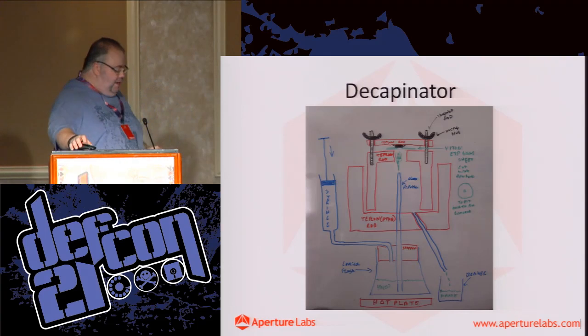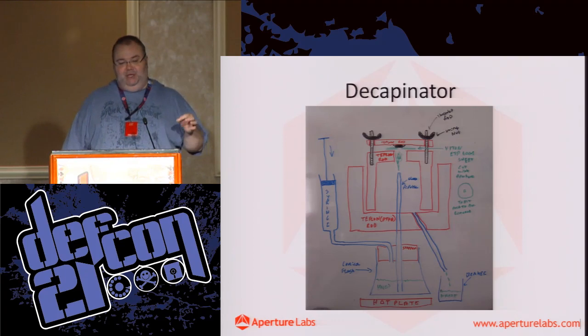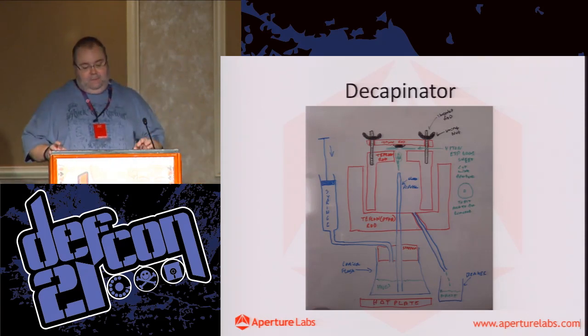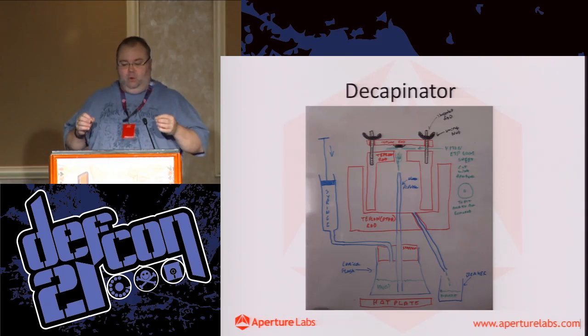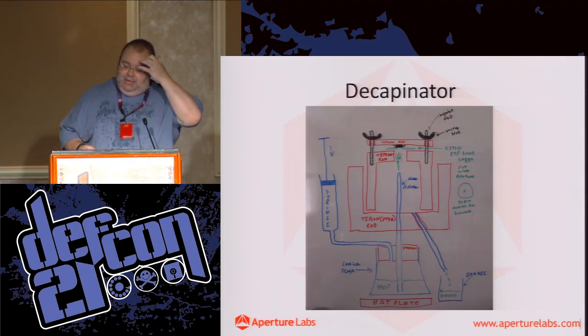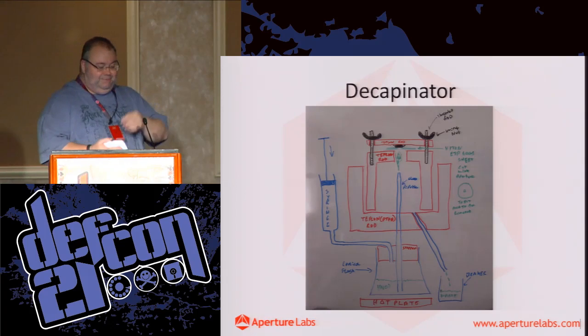I learned a little bit about pulling glass pipettes. It is simple, unless you want the pipette to be absolutely straight, in which case it's a fucking pain in the arse, but it's doable. And I also wanted to be able to control where the acid was going to mask it into a particular area. So after a lot of research, I came across this gasket rubber called Viton ETP 600S.